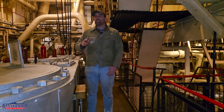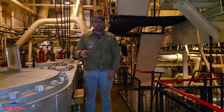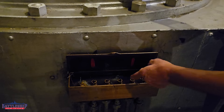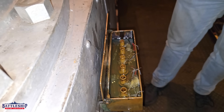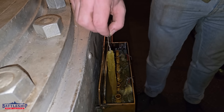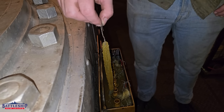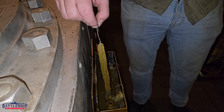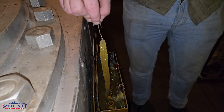The coolest system in the oiling process, in my opinion, is the wicks. It's the closest thing to the automatic oiling systems that you see on the Battleship. At various places where you need lube oil to circulate, they have boxes like this one, and each box has a wick in it. You can see this is just a regular undyed piece of yarn — or in this instance, several pieces of yarn.